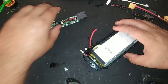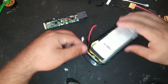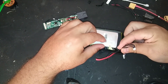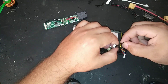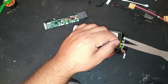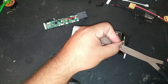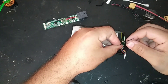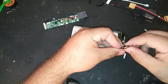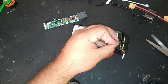That's our BMS, which we're going to be soldering to all these wires later. Now we need to get the balance lead cut off the balance pack on top — all we need are these wires here. You have to cut each individual wire by itself separately, because unfortunately these have power running through them. We'll cut one, move it out of the way, then number two, number three, number four, and number five.